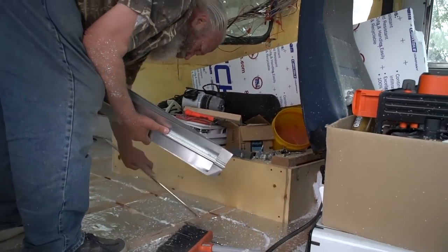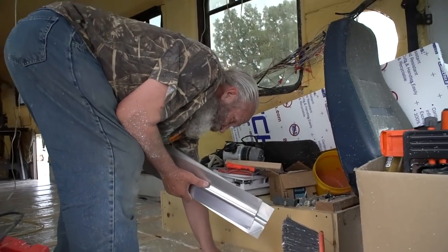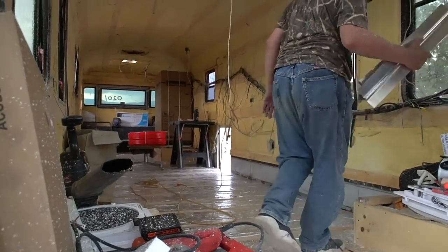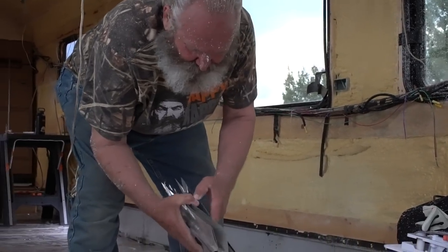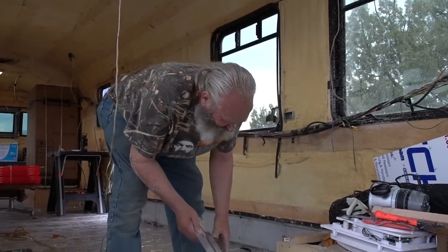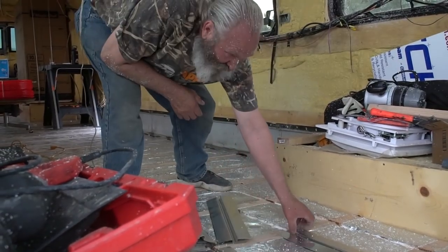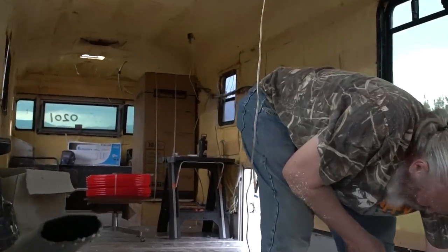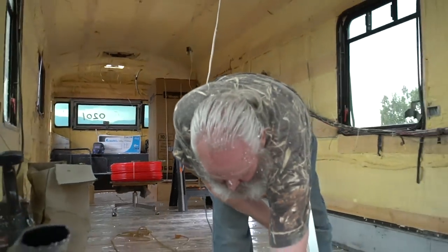All right Jim, what are we working on? Well, we're building a bus. It is a pretty big project. These are reflectors for the radiant floor. They're aluminum, so they're very good conductors. They're made for the PEX to fit in. Half-inch PEX fits right in there perfectly. So that's what we're putting in right now, getting ready to put our PEX in. There's the roll I got on Amazon and that's what's going to be running all through the floor.